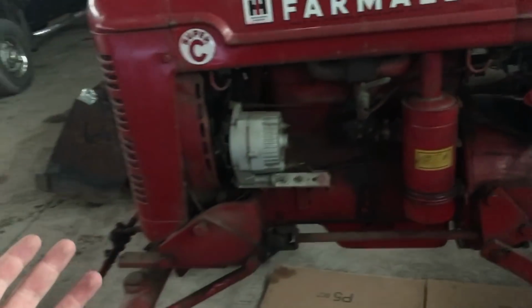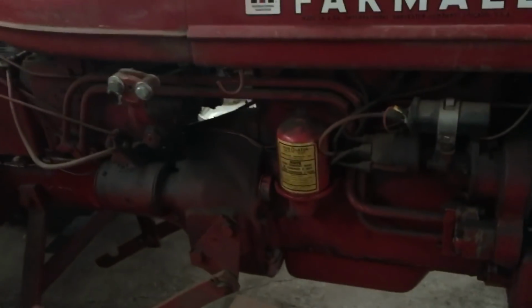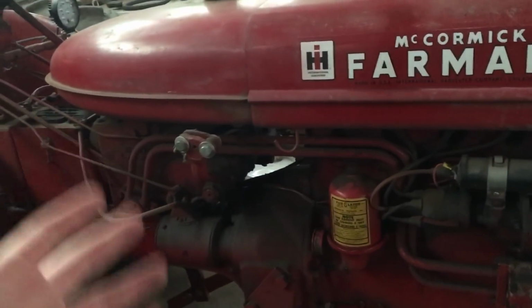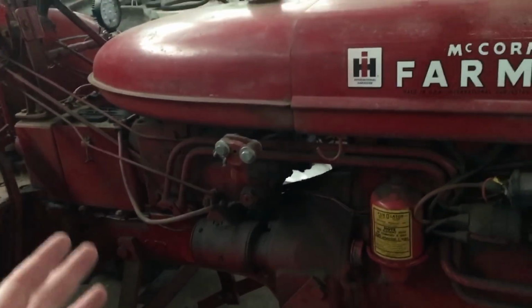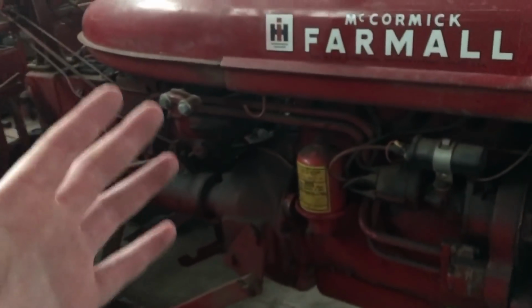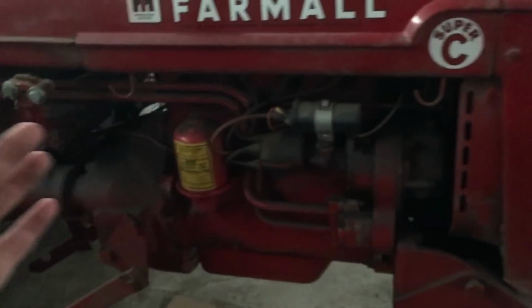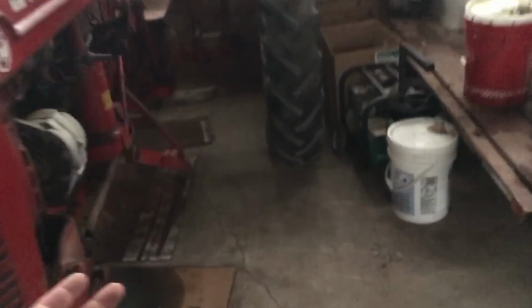It's the cheapest option, it's the cheapest route to go as far as diagnosing it, is to just change the engine oil. So that's what I did, and we got all that antifreeze and engine oil out of here, and put new oil in. And after all that running, I have run it more now, since I made the video, over the course of the month, probably more than I've run it all of the previous year. So you'd think if the problem was the head gasket, or one of the O-rings isn't sealed, any number of things, if it froze, all those things, you would think that it would all of a sudden be milky again.